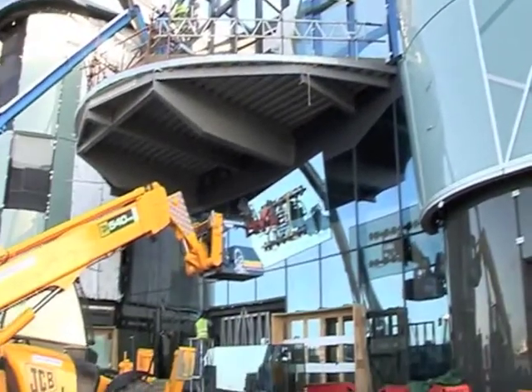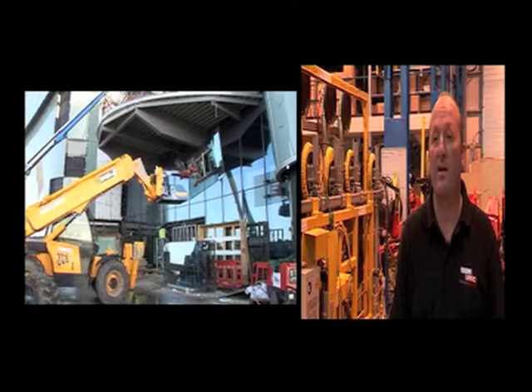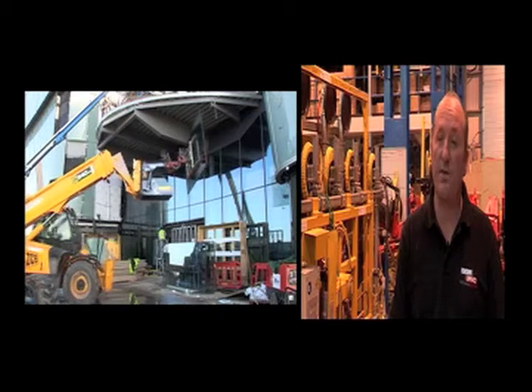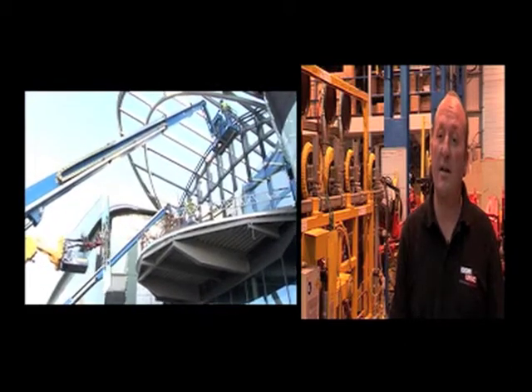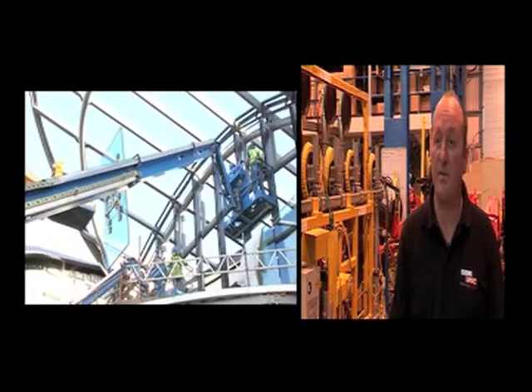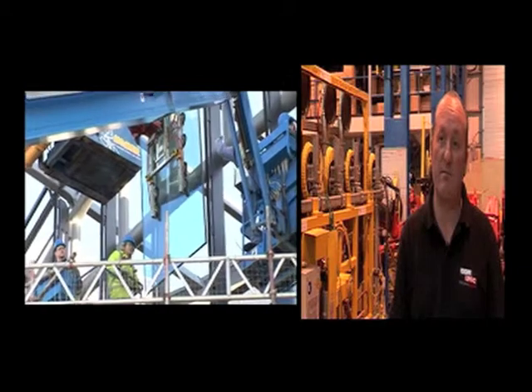The telehandler raises the machine with the glass on to under the soffit, to about a foot away. Then it's radio remote control, so you have an operator on a scissor lift or a cherry picker next to it. He can manipulate the glass into the opening under the soffit, so it doesn't matter if the glass goes right to the top — you've always got enough space to put the glass in.